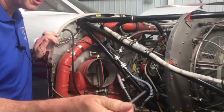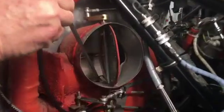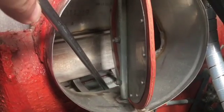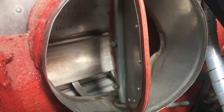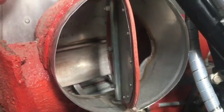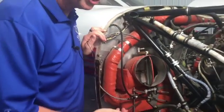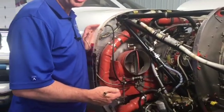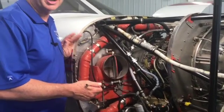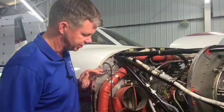The air comes into the cabin via the NACA inlet and then goes down inside here. If you look down inside there, you can see some radiator-looking stuff — and that's exactly what it is, it's actually like a radiator. The air that comes through here and the air that goes through here never mix with each other, just like a car radiator where the water never mixes with the air flowing over it. It's just a heat exchange.